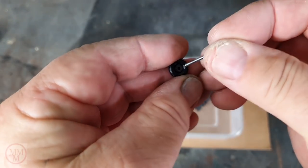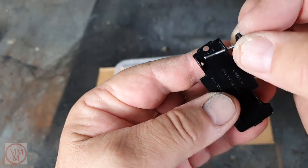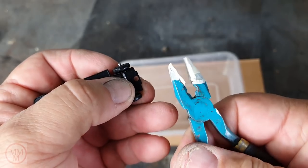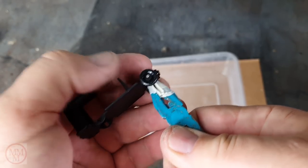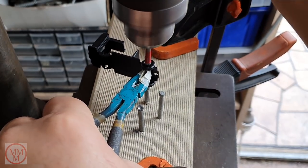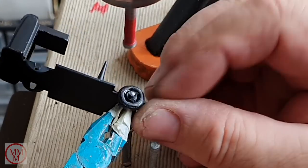So now I'm out in my shed, and I'm going to put these wheels and axles back on the base. Simple case of using two modified nails in my drill press. And I hold the axle with these small pliers. I've put some paper tape over the jaws so I don't mark the base. Now, I saw someone else's channel the other week. A guy actually did this in his hobby shop at the bench using a hand-powered battery drill. So if you haven't got a drill press, do not panic. It can work just as well with a small handheld battery drill.